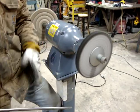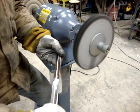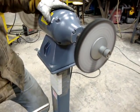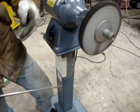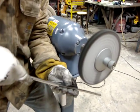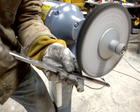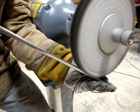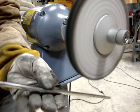I've got gloves and I hold my material very soundly. You never want to put a leading edge in — it'll bind it up. I've got my buffer bolted to the floor, and it's bolted in a direction that if anything does get caught, it's not going to do any damage. So I'm going to start by pulling away from the direction of the wheel, polishing or cutting as aggressive as possible.